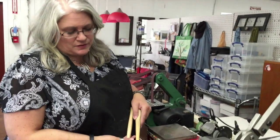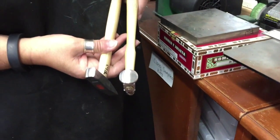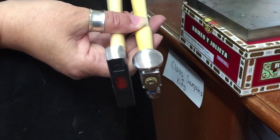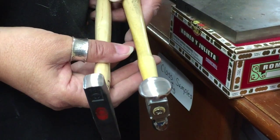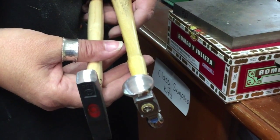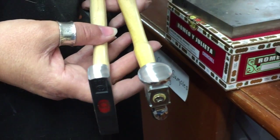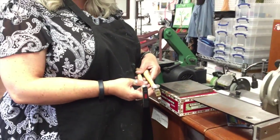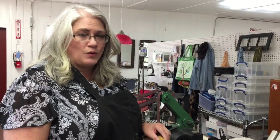So I've taken both of these hammers down pretty drastically, just up to the 400 grit. Now we've stepped it down to 600 grit and it's exactly the same as the previous iterations. Let me just warn you — you're going to be very tempted to run your fingers over that nice pretty smooth surface. The friction makes these hammerheads extremely hot. One of the choices you have is to dip it in some water and then dry it off before you move on. Otherwise, just be aware they're warm and they stay warm for quite a while.